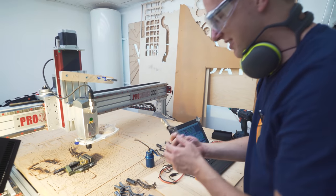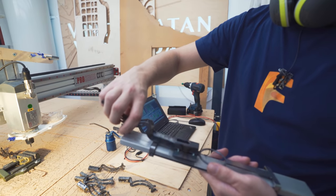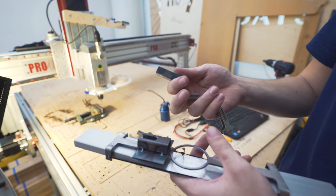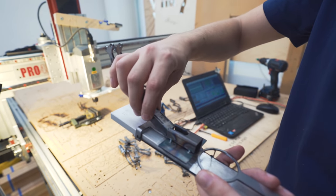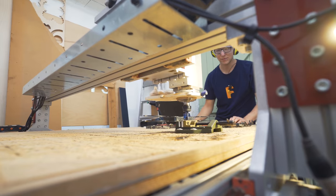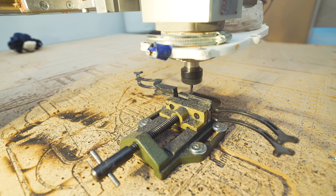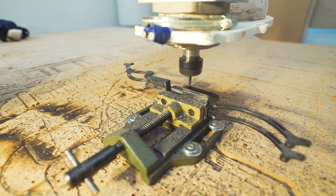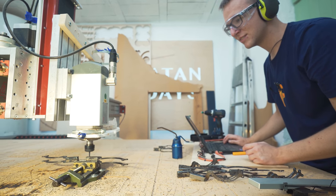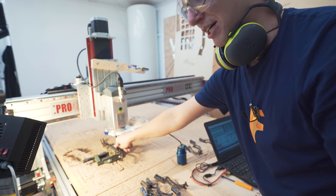I've made these arms - they should fit in the vibraphone plate holder but it's too wide still, because the material we had available is just a little bit too wide. So I'm cutting down half a millimeter on each side. I've already finished one part and that's how it should look like. I'm doing it on the CNC because these should be quite accurate - we have 37 different holders and every holder should fit on every arm.